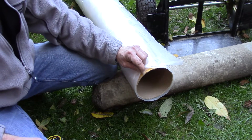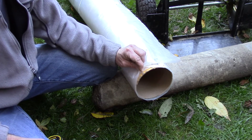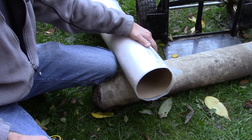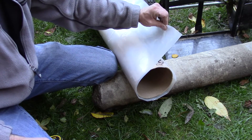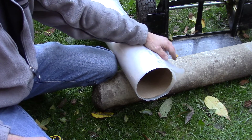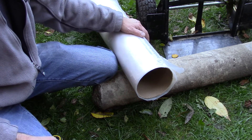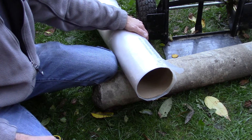I live on an island with lots of rocks in the middle of the St. Lawrence, and what I do is I cover my sono tubes with polyethylene plastic before I pour the cement. Use five or six wraps of a doubled-up vapor barrier and tie wrap it to the outside or tape it, put it in the ground, pour your cement, and it should be good for you. I've been working for almost 30 years with this technique. It should outlast your deck that you've just made with your funky pressure-treated wood.